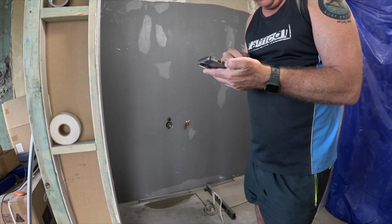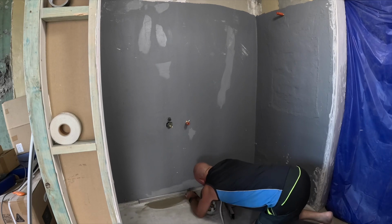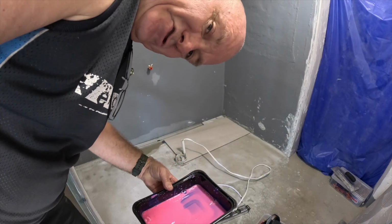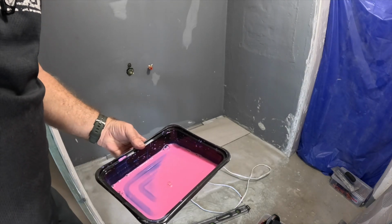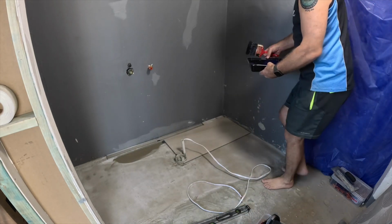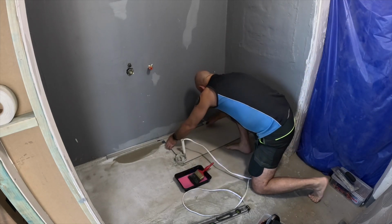And I'll measure it again when I've laid it, but now I'm going to put shims under the tile to get my levels right. And I will actually leave them in place when I put the glue in there. Actually, before I go to lunch, I've got some primer to put on the floor. Apparently this will increase adhesion. So I'm all about getting the best possible advantage I can. So I'm going to whack this down, and it needs a little bit of time to dry.